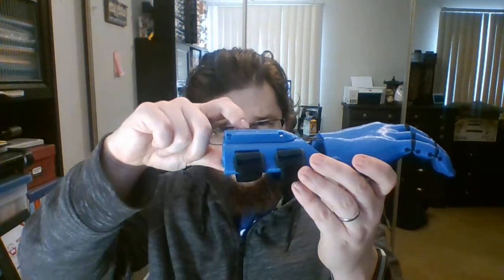A little function test — it grabs this bottle of hand sanitizer pretty well, and the thumb does close on the inside of the index finger. One thing I learned: I wish there was more — infinite — adjustability in the finger tension. It's very hard to balance the tension of the tendons just by where you tie the knots, with only a finite number of holes where you can anchor the tendons. That made it very difficult to get the fingers tensioned properly so that things close in the right order.